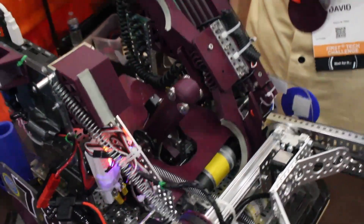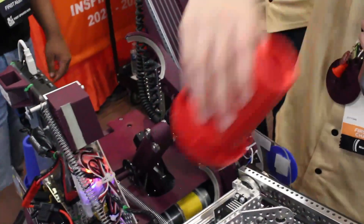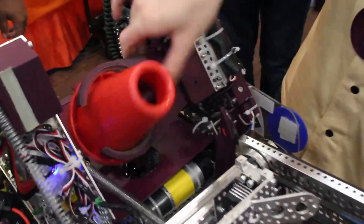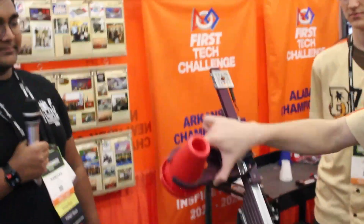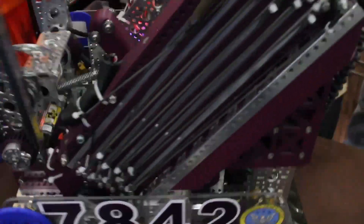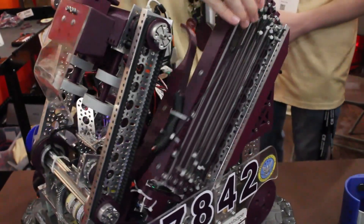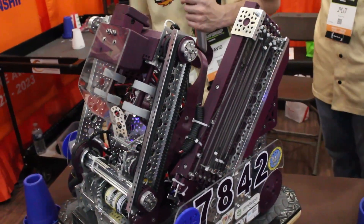Going on to your deposit — walk me through it. Once we pass it through to our middleman, we have a herringbone-like claw right here. It's just driven by another Axon servo. It grabs onto the cone, flips the middleman out of the way, and extends. It's a one-motor lift — we don't have two motors. But it's very fast because we have counter-springing on the outside. Just like our arm is sprung on this side to counteract gravity, we have surgical tubing on each stage of the slide so that it can pull up a lot quicker every time. Our motor has been struggling a little bit, but it's worked really well so far.